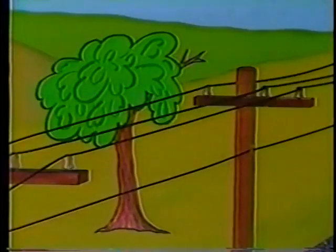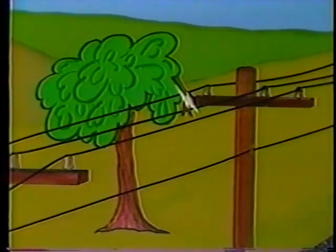However, on distribution lines, a fairly common cause of a permanent fault is when the branches of a tree fall into contact with the conductors, causing a phase-to-phase or phase-to-ground fault. Now, bearing in mind all that we have said, it is obvious that the type of protective scheme chosen will depend very much upon the installation itself.